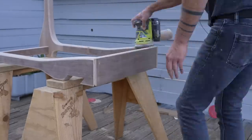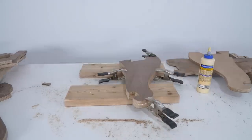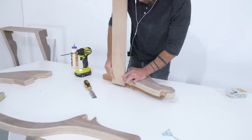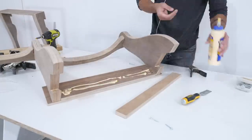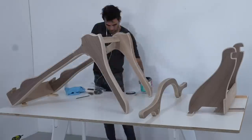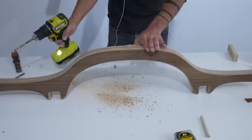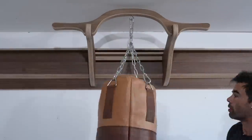If I was building this for a client other than myself I'd probably use real walnut plugs, but for my own use I'm perfectly okay with finished screws and a little wood putty over the top. For the bag holder I want a lot of strength where the device meets the French cleat, because the crossbar that holds the bag is removable so I'm not getting extra rigidity there. I fill exposed pocket holes a few different ways — sometimes wood putty, sometimes dowels flush-trimmed, but this time I just cut another panel and glued it on to cover up the pocket holes. I'm using a water-based polyurethane as a finish, two coats with a light sanding of 400 grit sandpaper in between.